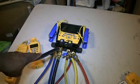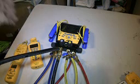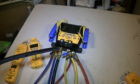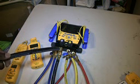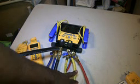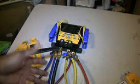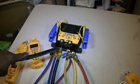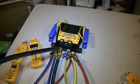Now, I haven't really used the vacuum port that much on my other S-Man unit when it came to recovery, for the most part because I didn't have 3/8 inch hose at the time, and my line set hoses did a pretty good job. But after being in the field for a little while, you get a better understanding of pulling vacuums, doing recovery and stuff like that. Having a 3/8 inch hose is a great way to go.